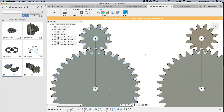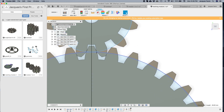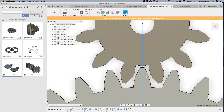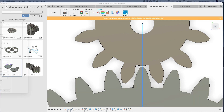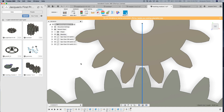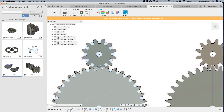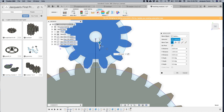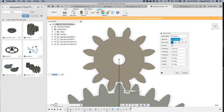Now, backlash. There are two sets of gears that are the same — same number of teeth, same distance spacing, 48 teeth. The difference is the backlash. On one there's no backlash and the teeth are touching. On the other I have one millimeter of backlash — you can see it here. When 3D printing you want to add some extra room. Moving the gear away would be a bad solution; adding the backlash on the teeth is a much better solution.